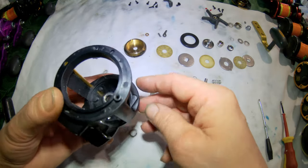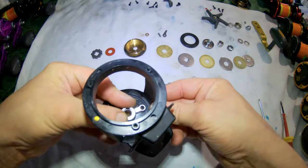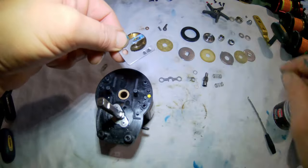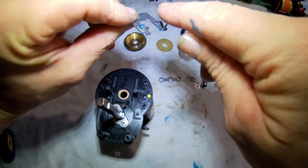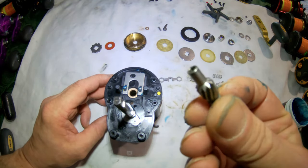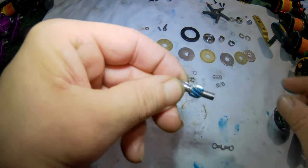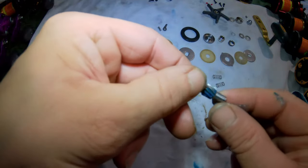Place the cover and the two screws. Now start the gear side reassembly. Fit the plate — put a little bit of grease under the back two legs and a little bit on top — then place it back in. Clean the pinion off, then re-grease and refit it. Apply a little bit of grease to the pinion itself and work it in — you don't have to go over the top, just a bit. Then place the guide.